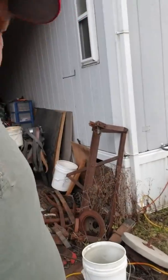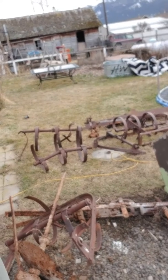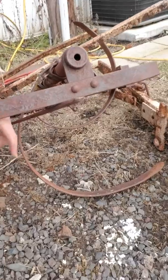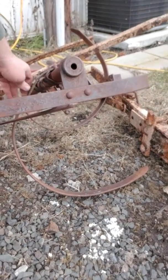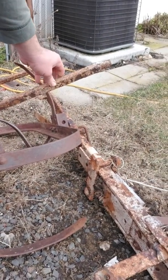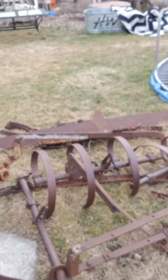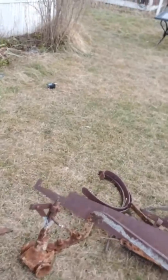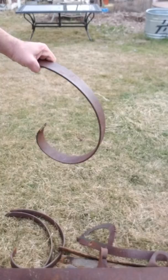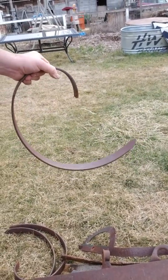Last but not least, I went out and talked to a farmer and got these - old plowshares or spring harrows. If you look at the harrow teeth right here, this part in here is perfect knife steel, sword steel. I'm going to make some racks and things out of this. He's also got some nice three-quarter to seven-eighths square stock, old saw blades, and other stuff. This is where the phrase 'hammering your swords into plowshares' comes from - this material is already that shape, and I'm going to make some knives out of it.